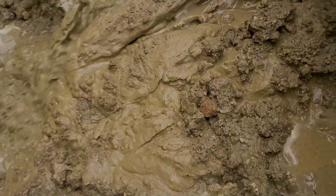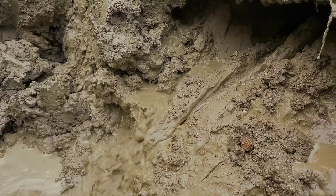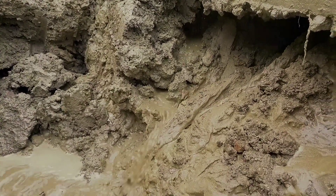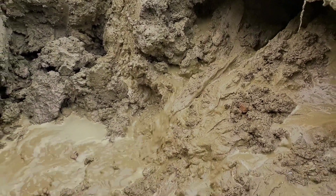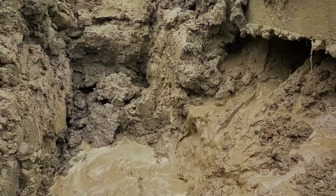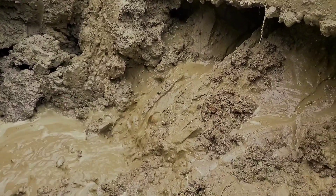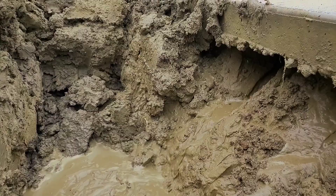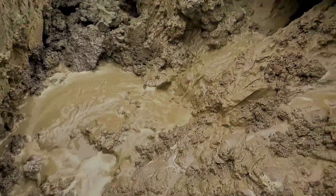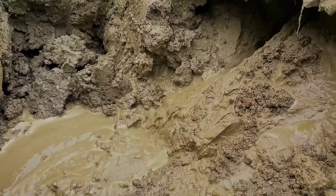That thing is gushing a lot of water — that's what we wanted, we wanted to hit that pocket of water. That's why he was getting water behind his pool liner. When you dig a pool in this clay area, you've just made a big bathtub.